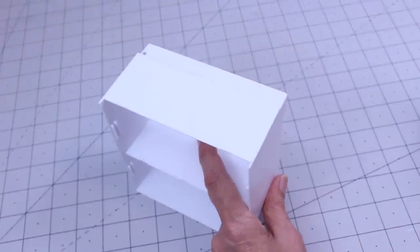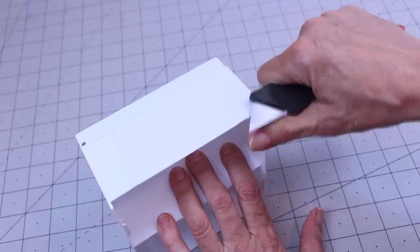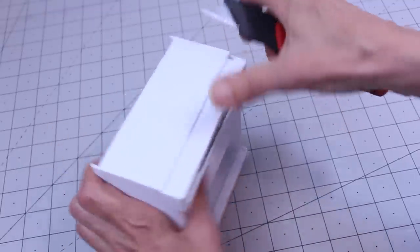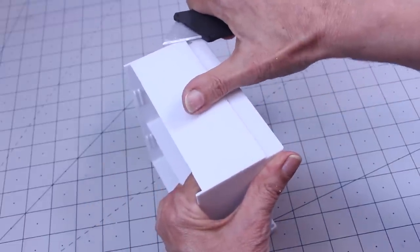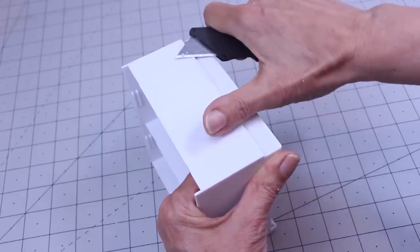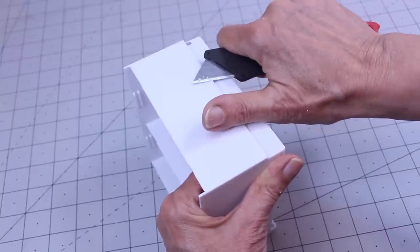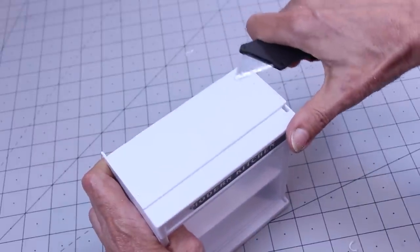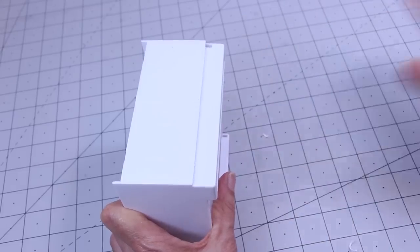So now that you've got it cut off, take the utility knife and trim off the excess little pieces. You'll notice there's a little rise on this side — we're going to have to build up with wood so it's going to be completely covered. Just skim off that little bit that's right in the front, and be very careful because we're using knives. The saw does a really nice job of cleaning that up.